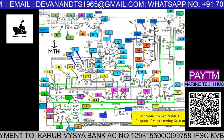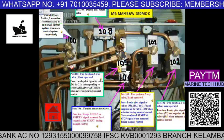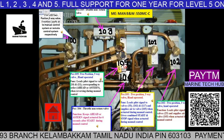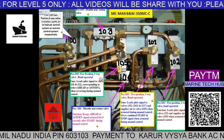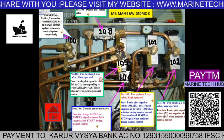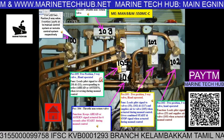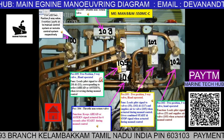All the components of the engine can be seen here by just clicking on them to see where they are. If you click 102, you can see 102 is here and the purpose of 102 is written over here. Similarly, the purpose of 105 — if you click on this icon — this block is position number 105, which is a two-position bypass valve which can be hand-operated. The function of this valve is to lead pilot air signals to valve number 10 and valve number 11 correspondingly, to order ahead turn or astern when reversing during manual control.